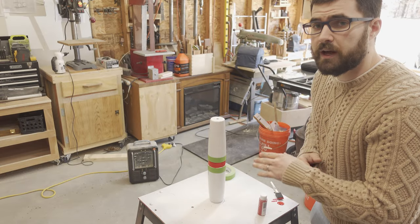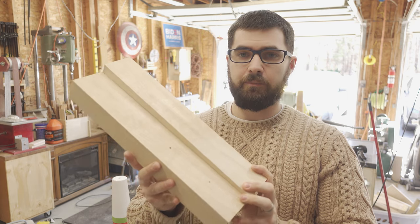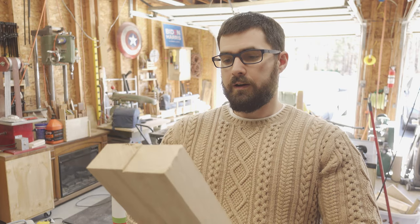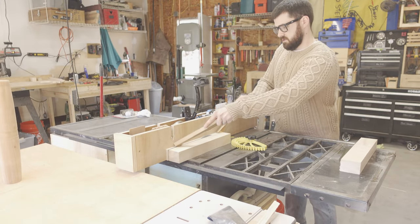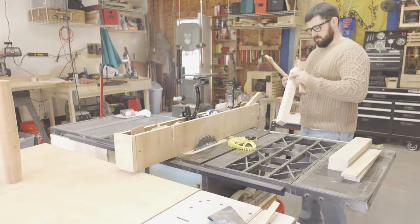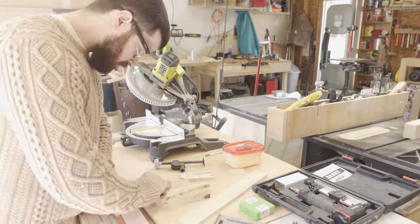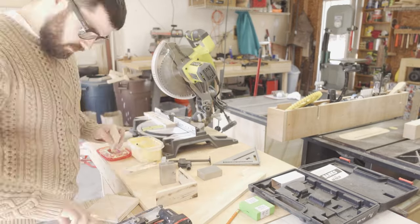First coat of paint for the red stripe is now applied and drying. Now it's time to direct my attention to the base of the lamp. I have a couple of scrap pieces of maple — I'm going to try to make the base out of these. This board has a pretty gnarly twist in it, but should be perfectly fine for creating a little base for the lamp. Starting at the table saw, I ripped a few half inch strips from the chunks of maple. I used a 4x4 piece of Baltic birch plywood for the base and, using my miter saw, cut the maple to 45 degree miters, creating a frame around the birch. I thought this would present the pin nicely and give the impression that it was sitting on a bowling lane.